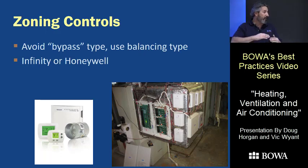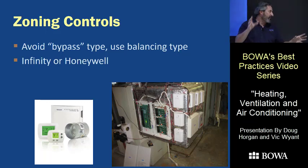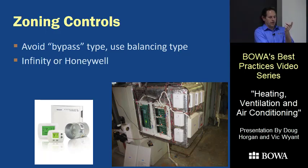Even trying to go even with one system doing first and second floor, the demands are so different it's going to struggle. If you can use two separate systems, you can just do whatever you want. There are higher-end furnaces and air conditioners with variable speed and variable capacity, and the better zone controls automatically turn the system down to lower speed or capacity when it doesn't need full capacity — those work much better than systems with a bypass damper. Try to buy the expensive equipment if you're going to do a zone system.